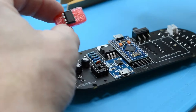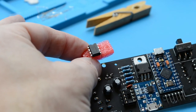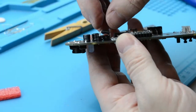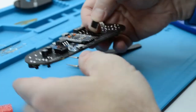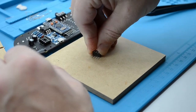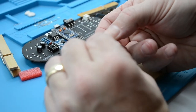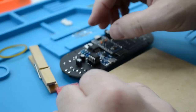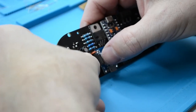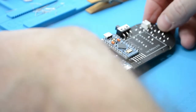Fitting the memory chip into the DIP socket. The memory chip has the same grooves that are on the DIP and the white outline on the PCB — make sure when you put the memory chip inside the DIP that these are aligned. If you have trouble placing the memory chip onto the DIP, it may be because the pins are slanted. To fix this, use a hard surface to push the memory chip pins back into a 90 degree square position on both sides. Aligning the grooves on the memory chip and the DIP, place the memory chip in the DIP with a firm press. It's important not to force the memory chip in, as both the DIP and memory chip can be quite delicate.